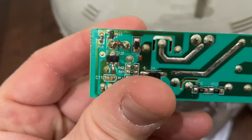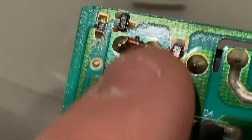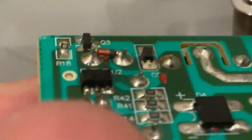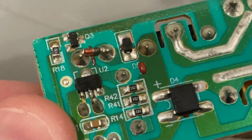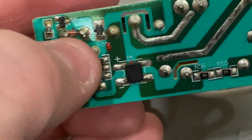This electrolytic cap dried out completely. I don't know what in the world is that bridging across it. That's interesting. There's like a Zener diode that's basically connected across the leads of this cap. Okay, haven't seen that, but there it is. And there's something, what did they do? Wax it down there so that it would stay. There's this brown reddish stuff there and there. So I'm gonna have to figure out how to put this thing back in the same configuration, but I have not seen that before. That little tiny Zener, what looks like a Zener diode across that capacitor, EC3, okay? But yeah, if I unsolder it, it should come off, and then I have to be careful just to make sure I put this thing back where I found it. Little surface mount there.